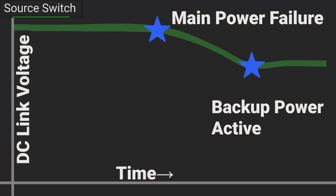However, as the high-voltage DC bus fails, that DC-to-DC converter will naturally ramp on, preventing the DC bus from drooping below 250 volts. In this way, no hard switching is required, and this change may completely eliminate the need for a hot-swap controller and the need for relays — which is actually a pretty big deal. I think we may be able to use simple diodes rather than active switching on that DC link too, managing complexity. We're handling less than 10 amps, and this choice could potentially improve modularity substantially. All power sources are a one-way street either onto or off of that DC link.